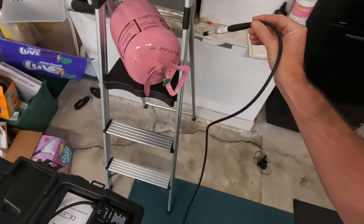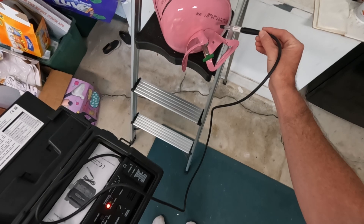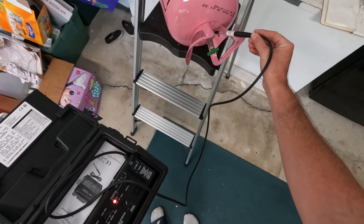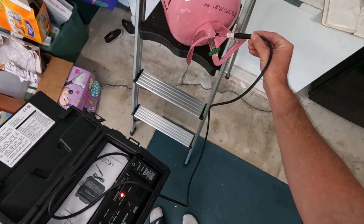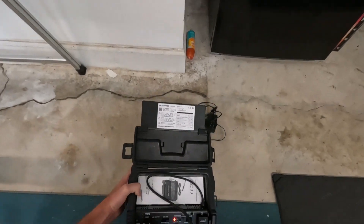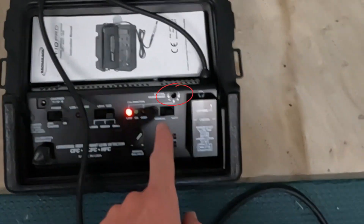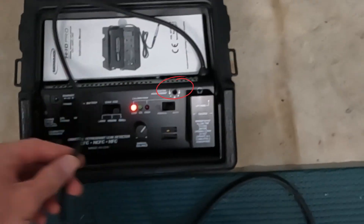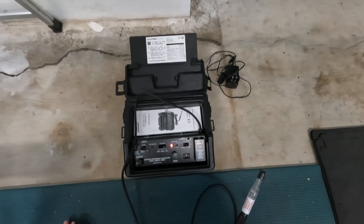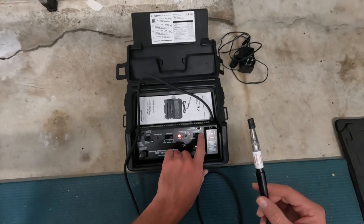See what we got — that's auto. Now I'm going to show you what I did: on the heater adjustment, you just put a small flat tip or thermostat screwdriver flat tip in there, and you can turn up the heater adjustment.